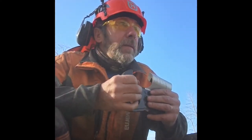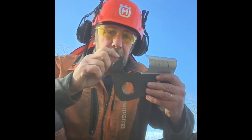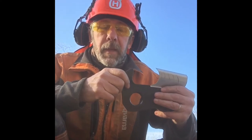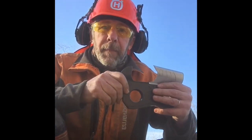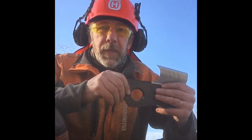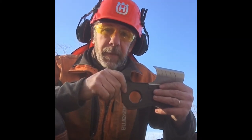So grab a piece of paper and a crayon. Number one is this guy here in the front — its proper name is a depth gauge. Common names depending on where you are regionally include raker, drag, or rider — it has a lot of nicknames. This tooth determines the thickness of the chip. On common chain nowadays, they're set right from the factory at 25 thousandths of an inch. We modify them a little bit depending on what we're doing with the saw, but that determines the thickness of your chip.